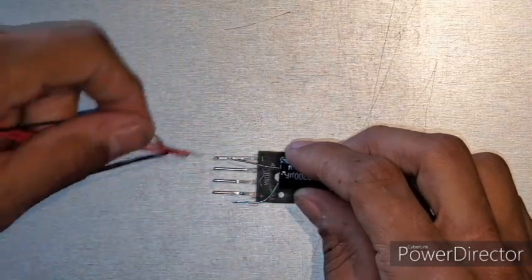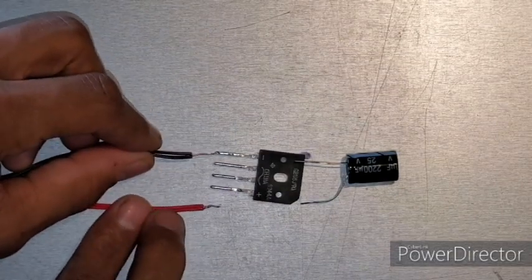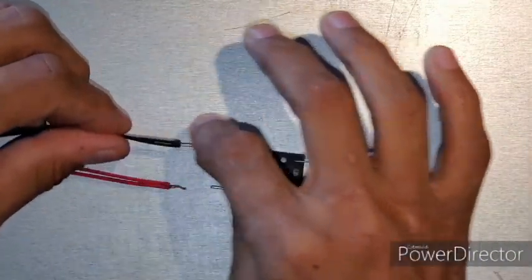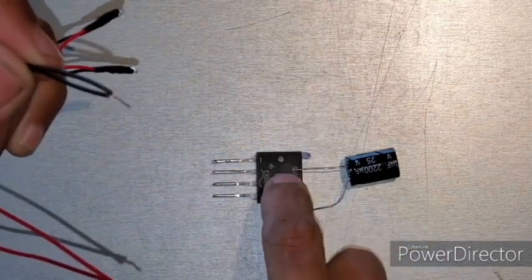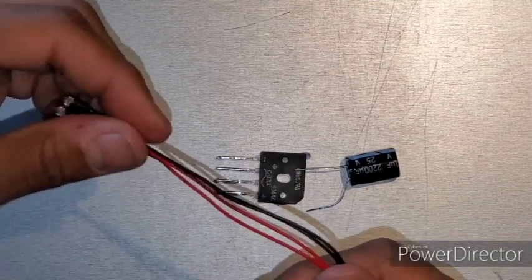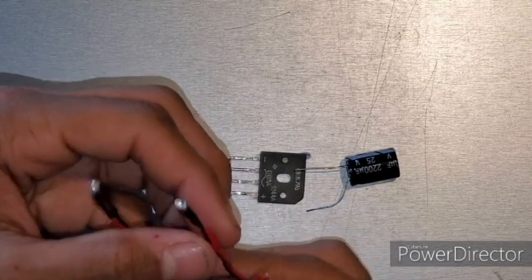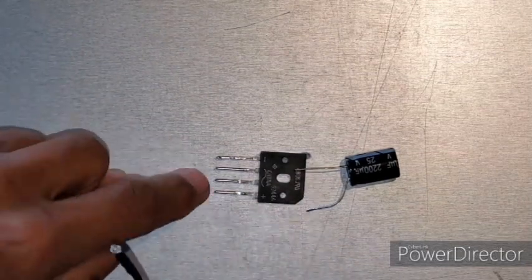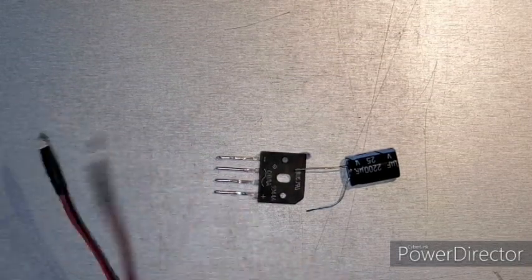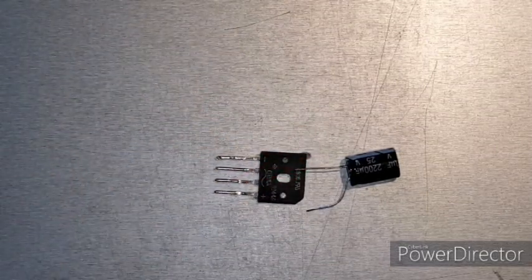Same thing with your LEDs — however you orient your LEDs, you put them on this way. If you have heat shrink, slide it onto the wire before you add your LEDs to the bridge rectifier, then slide it all the way back. This one is using two LEDs because I use two in my cars — left and right. You can do a single or however many you want.